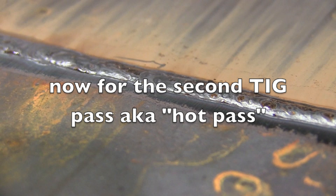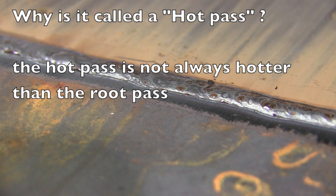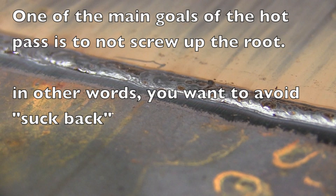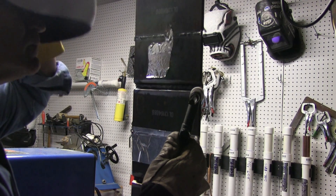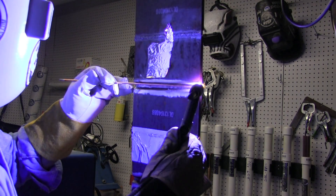Now it's time to put the hot pass in. Welders call it the hot pass, but it's not always hotter than the root pass with TIG welding. You've got to remember one of the main goals of the second pass — or hot pass — is not to screw up the good root pass you just put in. So if you pushed a nice root pass through there, the last thing you want to do is suck it back. I'm going to flick the rod to start the arc for the second pass, also called the hot pass, and I'm set at roughly 120 amps, still using the Miller Thunderbolt.